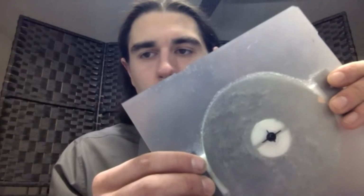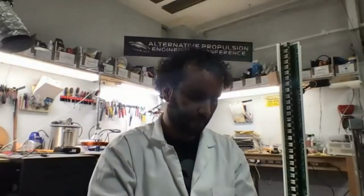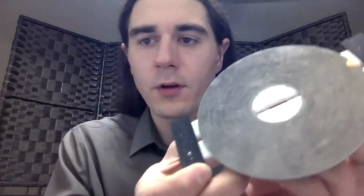So this was one of the assembly pieces for the first generation Bandurk device, and here we have our dot product disc, and this has about 5 grams of tin and about 1 gram of epoxy mixed in on the surface here. And you can see these rings around here, and these are caused by the ultrasonic vibrations that we placed on the disc during the forming of this material to try to distribute the particles out evenly within the mixture.